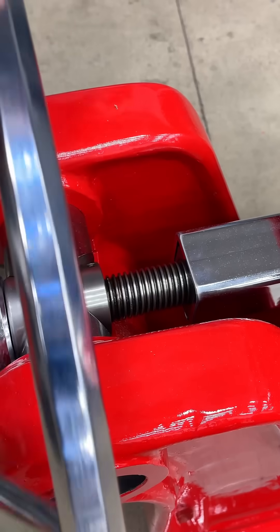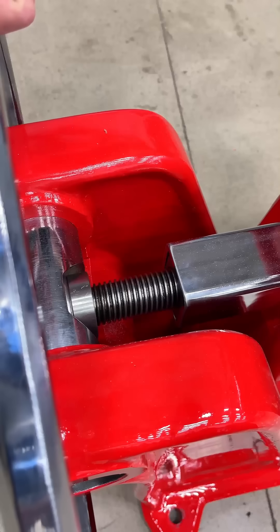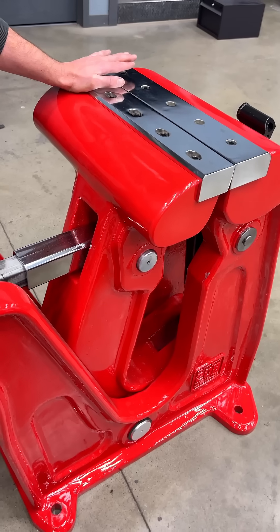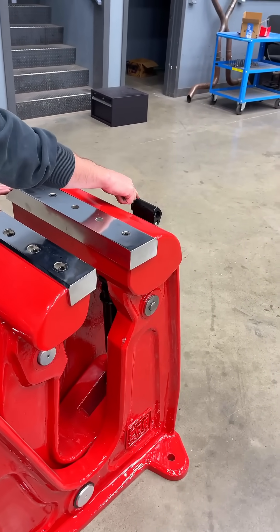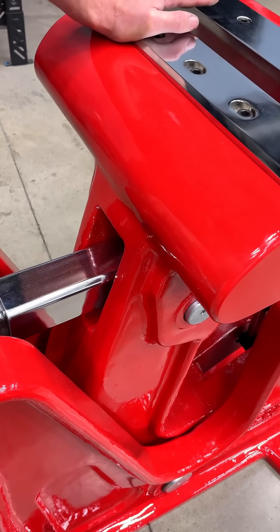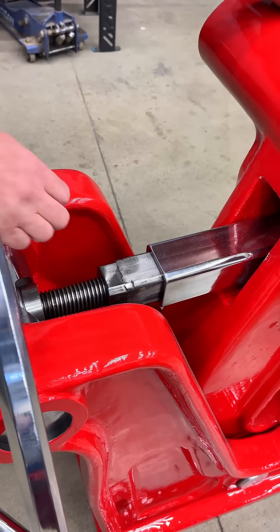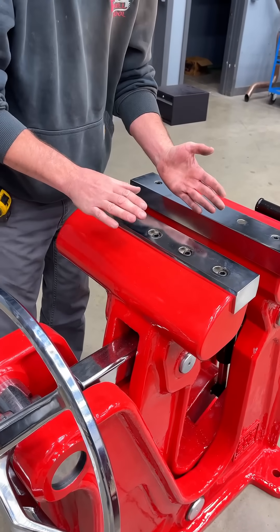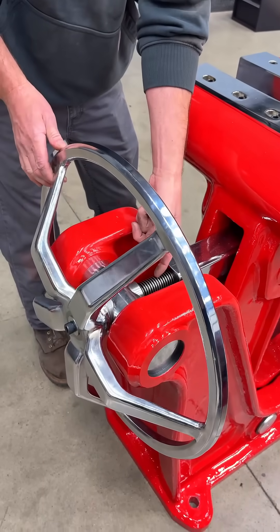As you can see it has a really nice motion. This is a left-handed thread, so when you turn it right the jaw goes forward. This jaw is floating — whatever attachment is on the back side, whether it be a hydraulic cylinder, once this takes over it just lifts off the screw and pushes in, but it can slide off of it. This is so it doesn't pull on and jerk the threads off. Because of the way we've designed it, the dynamic jaw is weighted, which means it wants to go backwards just because of gravity, so it's always riding on the back side of the thread.